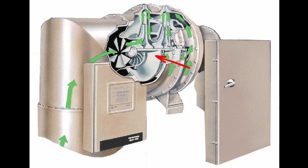A three-stage — CVH-E or G — would have three impellers. So in a CVH-F with two impellers it's two-stage, and the second guide vane is a variable guide vane. That is the armature that sticks out the side here, controlled by the actuator. In a CVH-E or G, the second impeller has a fixed guide vane, and it will flow through its impeller into its diffuser and into a variable guide vane for the third stage impeller before it cycles around and goes out the discharge.